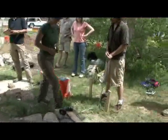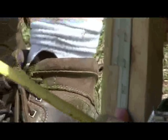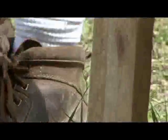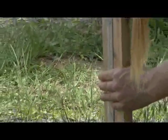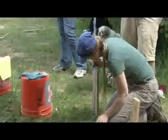Jan doesn't have to stay with the hold for too much longer. We're going to come over here — since water just seeks its own level, we'll let it level out. I'm going to mark it there, and then mark it on this side too, marking it down three quarters when you move to your second location.